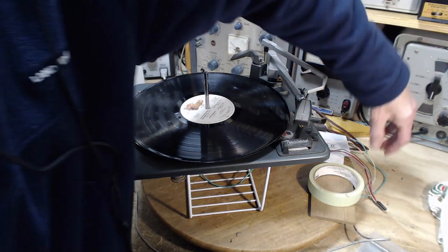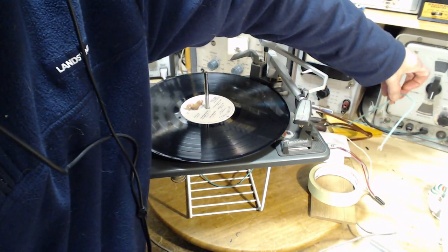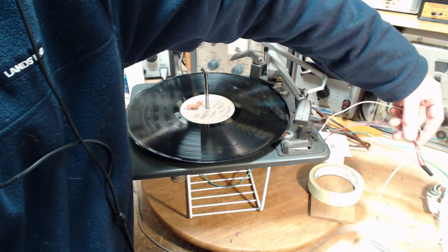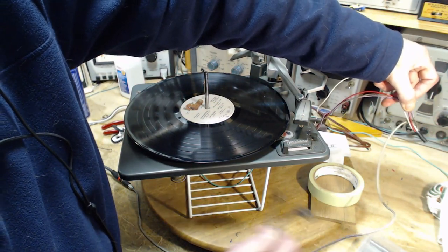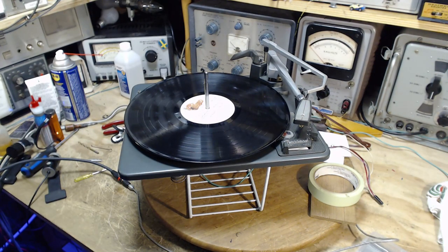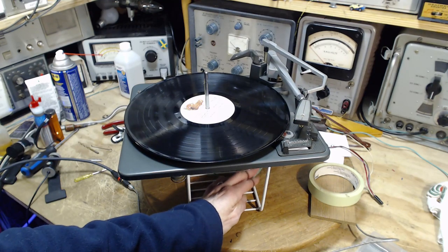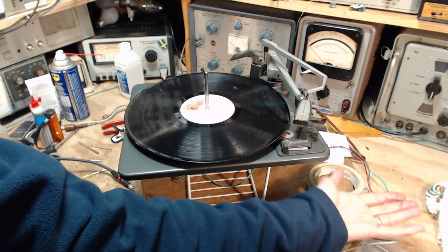So this cable must not be attached. Yeah, it's not. Here's the green wire. It looks like it's just ending over there. So this cable will help as long as it's grounded somewhere. And probably when we look at the amplifier and the rest of the console, we'll discover how that's grounded. But normally, plus this green wire is going to override anything anyway. The green wire is connected back to the radio chassis, the amplifier chassis.